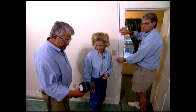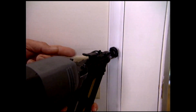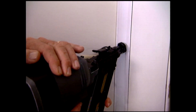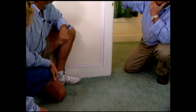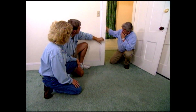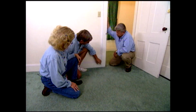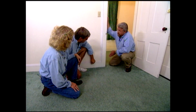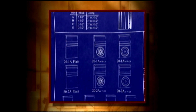There's nothing like a nail gun for installing molding quickly and easily, especially in an old home like this where pounding on a wall with a hammer can cause cracking and damage to fragile plaster. Although with proper eye protection a nail gun is perfectly safe, there is a backblast of air and sometimes it can be a surprise. A few more nails and Mercy uses the gun like a champ. I think it needs something — if we added another piece of trim on the face of the flat part here, that would start to give it that build-up effect we're looking for. Normally this would stop on a plinth block down here. A plinth block is a decorative piece of woodwork that can simulate the base of a column when used at the bottom of a door or as part of a fireplace surround.